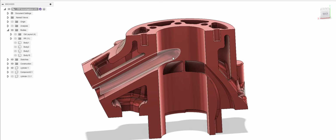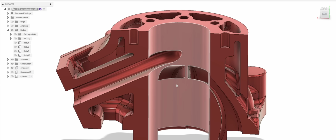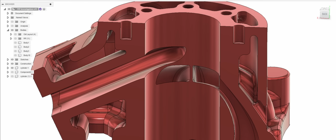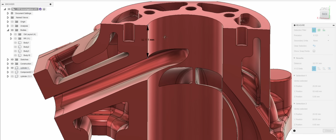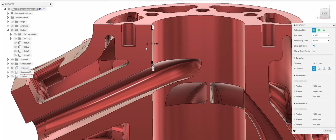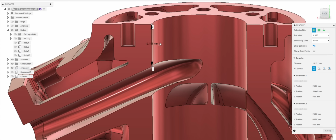It doesn't matter, the port timings and everything should be the same. So first up, what we need to check when we take the top off is the distance between the top of the exhaust port and the deck, the deck height. And it's supposed to be around 18.151 millimeters. And that corresponds to around 200 degrees of exhaust timing. So if it's far away from that, especially if it's far higher, then that could be our problem.